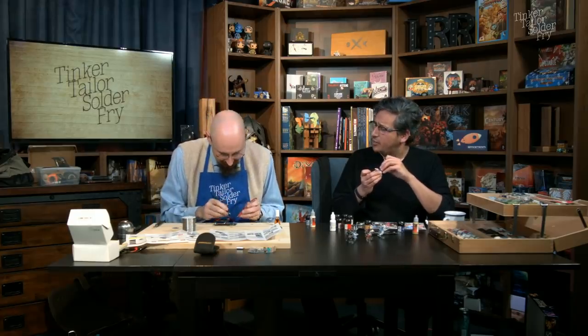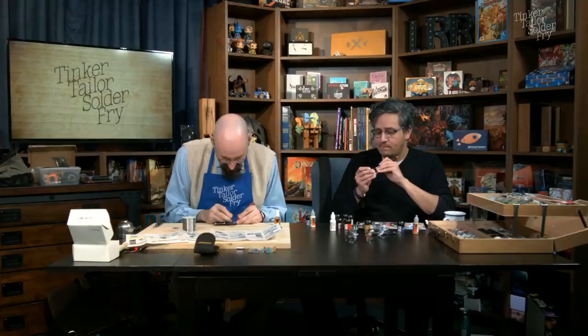The first time I remember using flux was for that job doing the chips on the Dreamcast. You just put flux down on the chip sides, put down a huge glob of solder, and then just rake your soldering iron across the chips. The capillary action, along with the function of the flux, just sucks the solder right into where it needs to be, making these perfectly crisp lines between the legs of the chip. Is there a NASA soldering guide? I know they have a splicing guide. Oh, yes. And it's part of the same family of products.